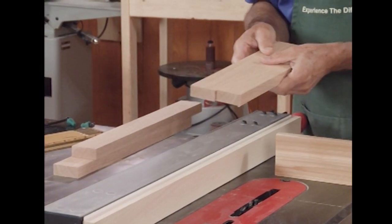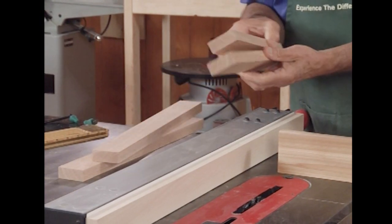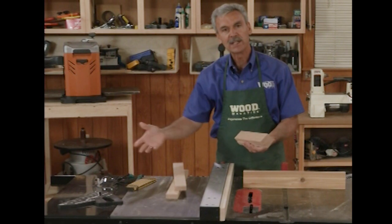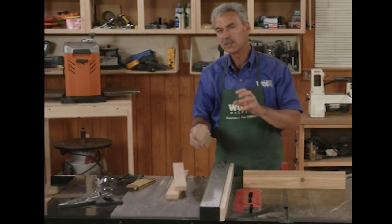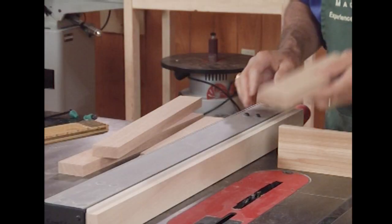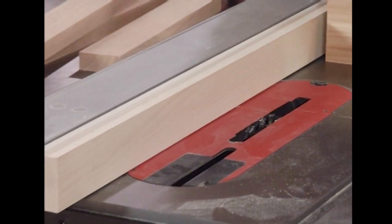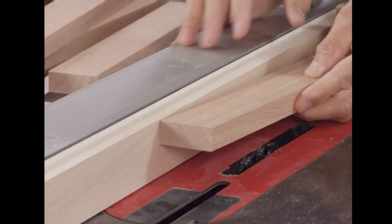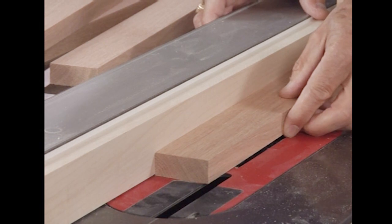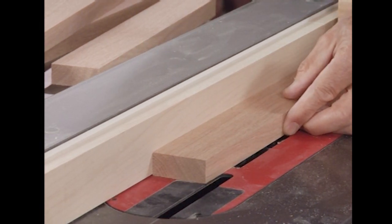The stock I'm going to use is a couple of pieces of oak — a couple of short ones and a couple of long ones. I want to make sure that at least they're all the same width. The half lap joint is real easy to make on the table saw. I'll start with this piece and make the width of this first pass, taking the actual side piece and using my fence to lay it out with the outside edge of that dado blade.